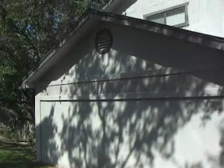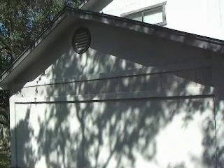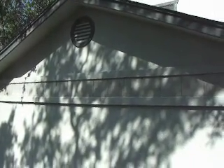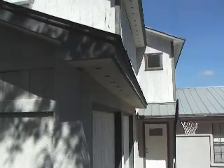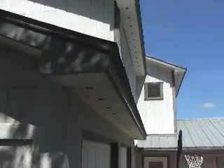We need to get our soffit done first for two reasons: our soffit needs to go on first so we can tie it against the existing stucco, so Trey can stucco up against it. Everywhere on the soffit that has stucco beneath it, there's no need for a frieze board because he's going to float the stucco right up to our soffit. We're keeping the existing soffit, cutting out holes for ventilation — all hardy vented soffit where there is vented soffit, and non-vented where there's non-vented, including the gables.